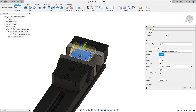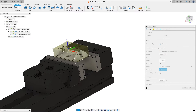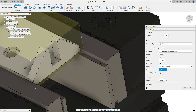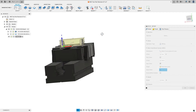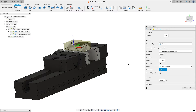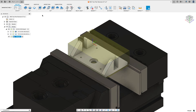I'll go back to my setup and click the white dot to choose where to locate the work coordinate system — on the bottom left back of the stock. Before putting the part in, I'll set Z off of the parallel, then set X and Y off the hat of material, which will be accurate enough for this operation. The goal is just to get rid of the hat of material. I'm happy with my choices, so I'll hit okay.